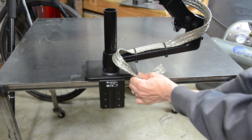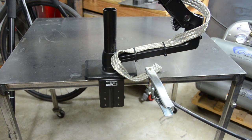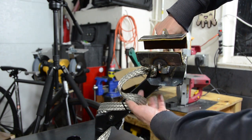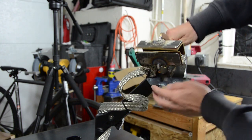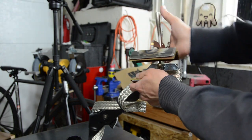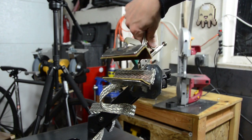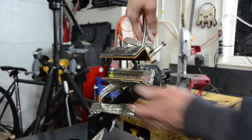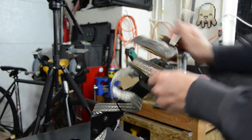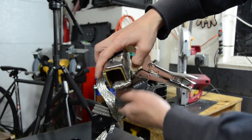This cable here is a ground. I'll put it like this and then loop my welder ground there. You can see the ground is looped up the arm, held on with zip ties, and it wraps around this clamp so that when I stick a tube in here it's touching the ground. This clamp is just a simple vice grip welded onto a plate here.